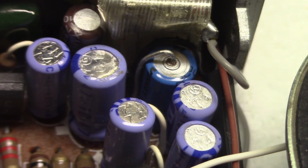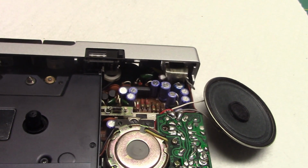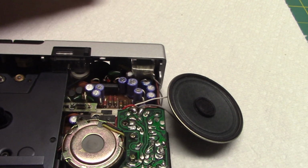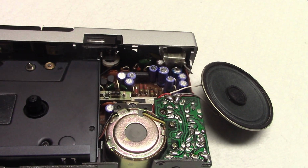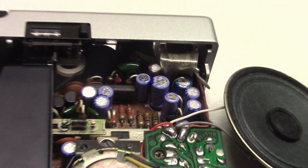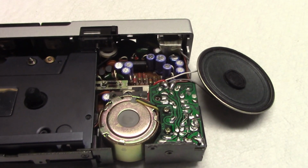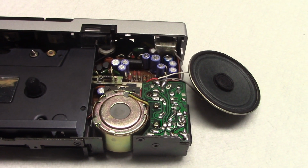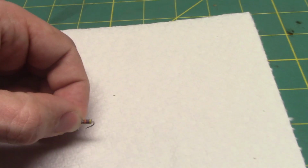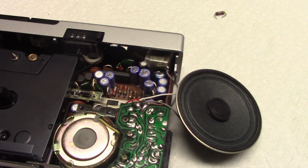You can see that little axial-leaded cap in there that has a lead bent down. It's a 220 microfarad cap replacing a 47 microfarad one in the ALC control circuit. The 47 microfarad capacitor in there was what I call automated level control hits, where it's kind of a weird sound whenever it first gets a stronger signal when it's most sensitive. So increasing the capacitor value will dampen that. I've done that before with the other chip, and then when I put the original type of chip back in, I wanted to see how it would go with the original value of 47, but seeing that we were still having some of those ALC problems, I'm putting the 220 back in there, and in parallel with the 220 microfarad capacitor, I put in a 47k ohm resistor to discharge the capacitor a little bit to make the recovery time, i.e. the time it takes for the recording level to get back to maximum, a little bit quicker because of the slower discharge of the 220 versus the 47.